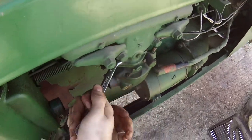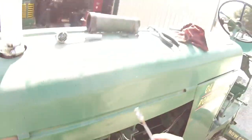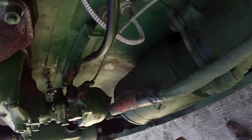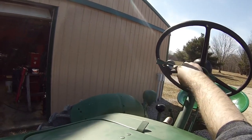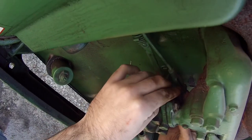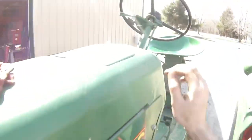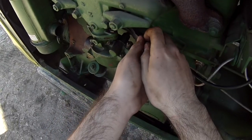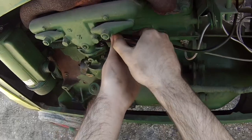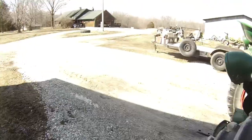There's that side, there's that side - I think this is the last one because we're getting pretty tight. I need the cotter pin and the pin, and I need to put the throttle back on. I might need to move it over slightly so I can get it towards the air cleaner - that's the hard part. Just bend her up or sideways so it doesn't want to move on you. Alright, moment of truth - let's see if I can do what I did on the 77. Let's see if she rolls over.